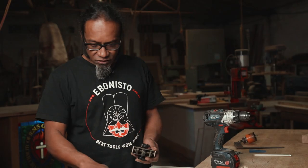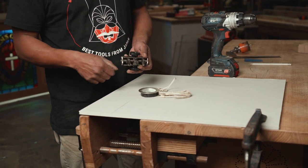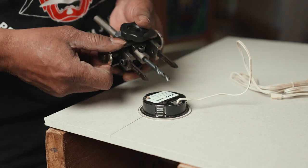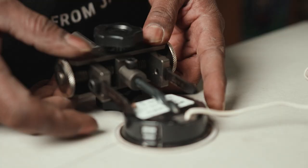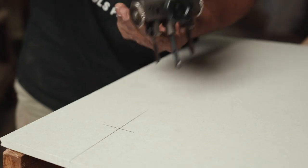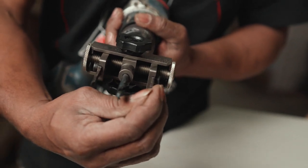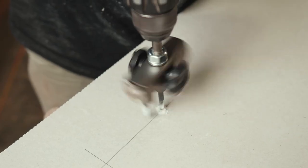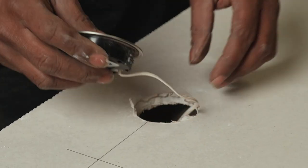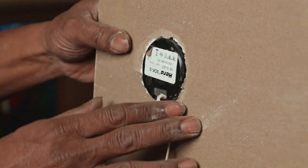The first example I'm going to show you is on a bit of plasterboard — drywall as you might call it. I'm going to fit this little downlight into what we have to imagine is our ceiling. I'll just open it up a bit so you can see what I'm doing. I'm happy with that for a first test cut, so I'll cut it a bit further. Always make sure this is tightly locked because you don't want it wobbling. There's a little bit of play in the blade which is designed in — it's meant to move a little bit like that. As you can see, it's quite nice and firm — no movement. Job well done.